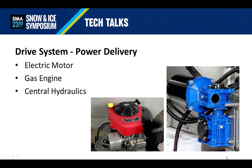Now you have an idea of the drive system type. It's time to decide how it should be powered. The options are an electric motor, which is a great choice for spreaders since they are sealed well to limit the corrosive environment from getting in, and they typically have enough power to run the larger drive systems from four to six cubic yards. The gas engine used to be the ideal power delivery because of its abundant power output, capable of tackling any application. However, they require more maintenance since they live in such a corrosive environment. Then there's central hydraulics, which are only a choice if you have a vehicle already equipped. Keep in mind, this type of system typically comes with very simple controls, which make it harder to determine the material output.